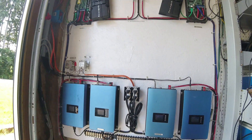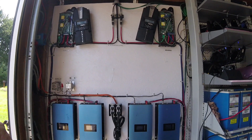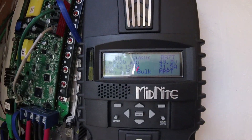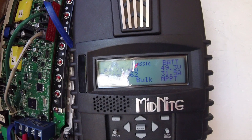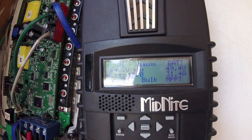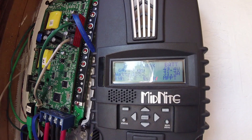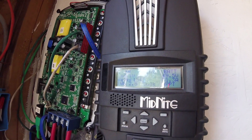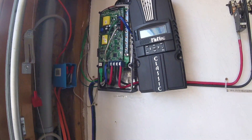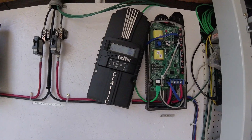This works with the commercial power all at the same time — it is grid-tied. It draws extra in from commercial power and uses solar when it can. Right here I'm running 49.3 volts, 31 amps, and in from the solar is 64, which is just perfect. That's why I ran two panels per string — it barely is above the 48 volts that I need, so there's not a lot of work the charge controller has to do. It keeps it cool, keeps it from overworking by keeping those voltages similar.